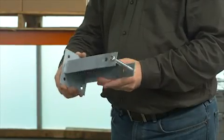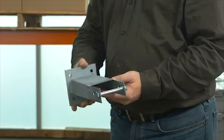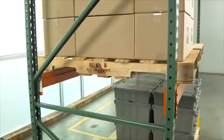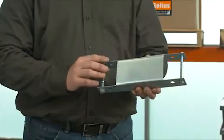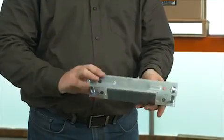Wall spacers connect racks to the wall for enhanced stability and are used to create a flue space or pallet overhang between the wall and the pallet rack, allowing for edge loading with an overhang space. Row spacers connect two rows of racks back to back and are used to create a flue space or pallet overhang.